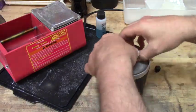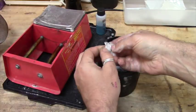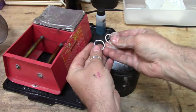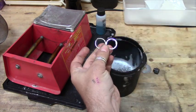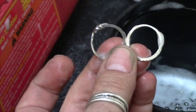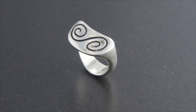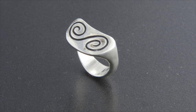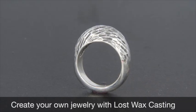I use a tumbler loaded with mixed shapes of stainless steel shot to burnish all of my models for easy polishing. Let's take a look at some pieces that were going in another batch — these are some silver rings. The shot just burnishes the surface and takes it up to a nice shine with no abrasion, so no metal loss. This is a good first step for polishing, and if the models are in good shape, they will produce a nice finish. These are some models after casting and after having been polished. I hope you enjoyed this short presentation and thanks for watching.